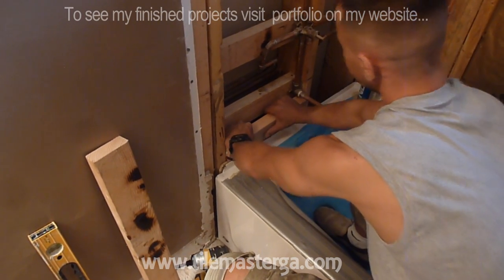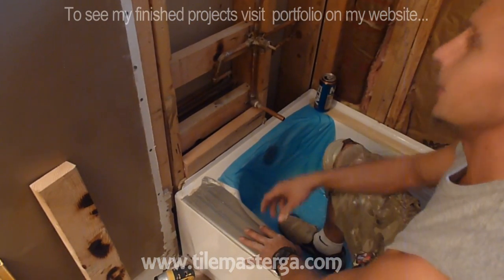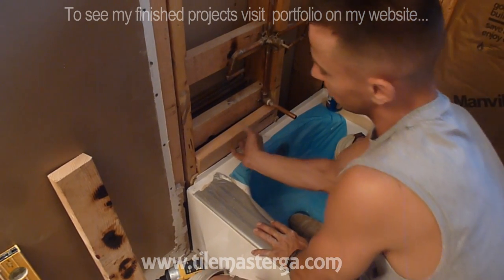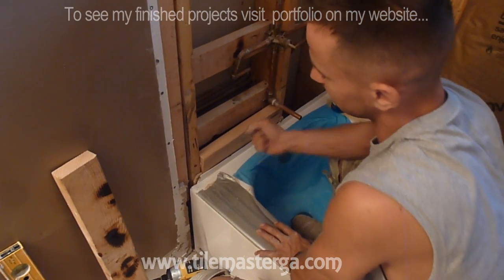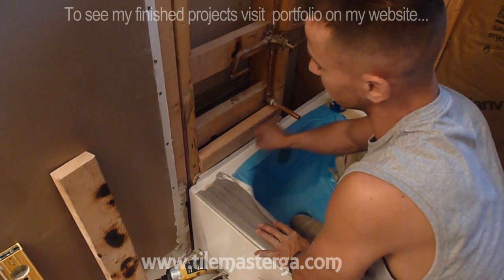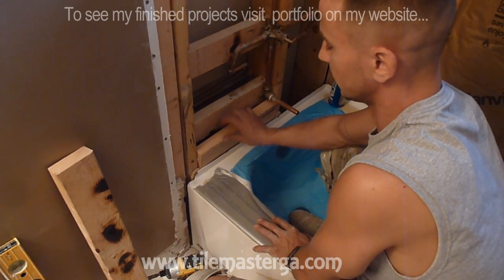So actually here I'm going to screw the blocks all the way around between the studs, and this way we have a very tight fit. The board will nicely hold on the bottom. It's going to be screwed in, and it will be an extremely durable surface.